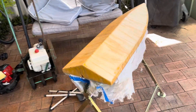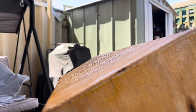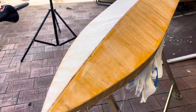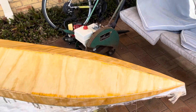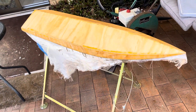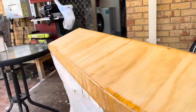So that is the fiberglass done - it's come out really nicely, beautifully smooth, nice and flat everywhere, no excess resin globbed anywhere. It's just a really nice thin coat. From here I'll give it another couple of coats of just resin - no more fiberglass. I'm only doing one layer of fiberglass which is just going to give it a little bit more structural rigidity, a bit more strength, more support on all these joins. It'll also give the next couple of layers of resin something to bond and grip to. Very happy.